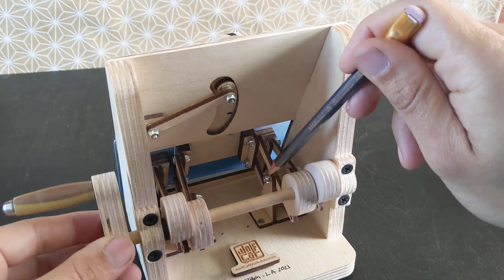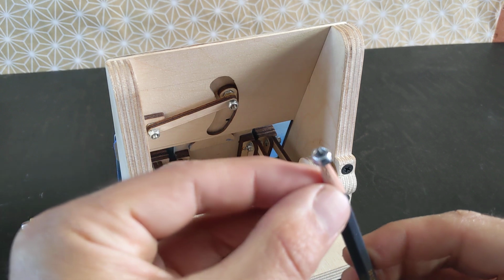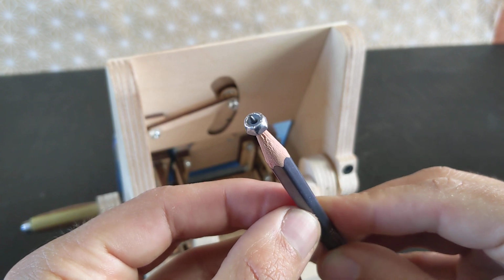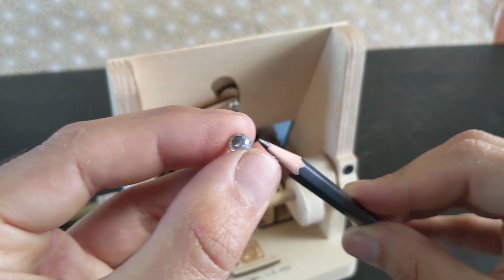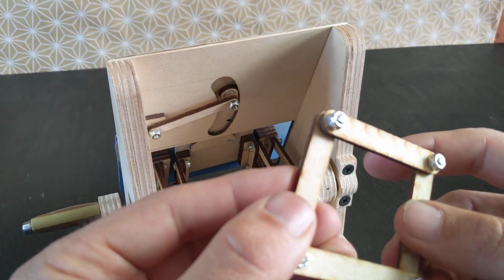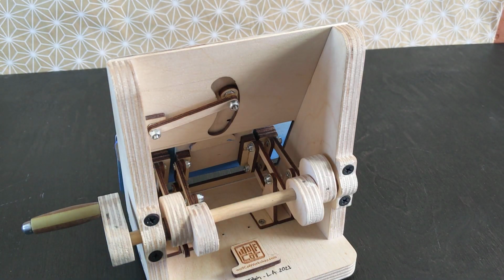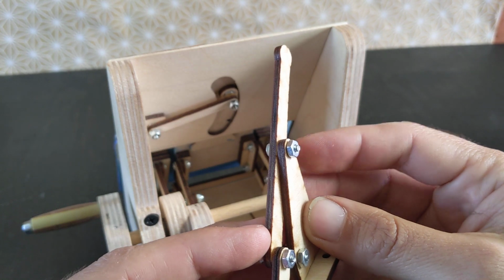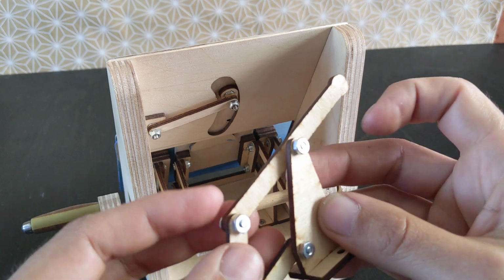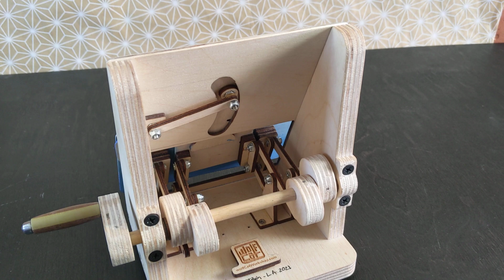And then all the nuts and joints, the screws and the nuts that I'm using for all these joints, it's important to use this kind of nut, which is called nylon lock, nylock, or nylon insert nut, because they stick to the place where you leave them. If you were to use this other kind of nut that doesn't have a nylon insert, you can see that it screws and unscrews really easily. So eventually this thing will come out of the calibration that you got for it.